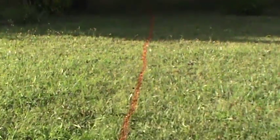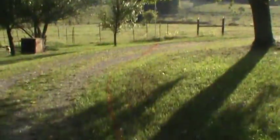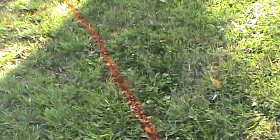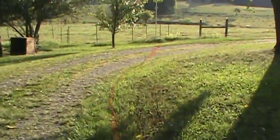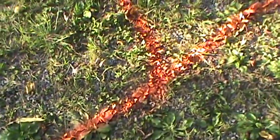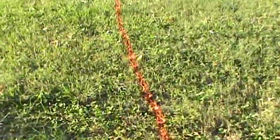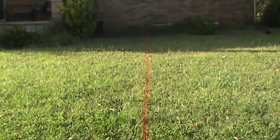We have now marked our trail for where the utility conduit will go into the structure, then turn and run back down to the turbine. Utility conduit is pretty long, and working with smaller pieces lets you flex it into the ground easily. Avoid overstressing the conduit — keep as straight a path as possible. An elbow will be used at the turn. Never take sharp turns, as stress can crack the conduit and damage or contaminate the cable inside.